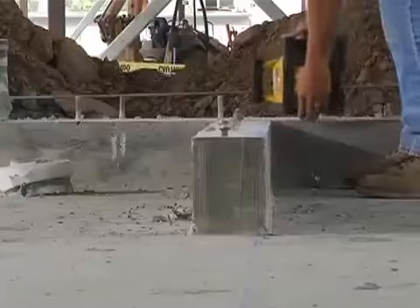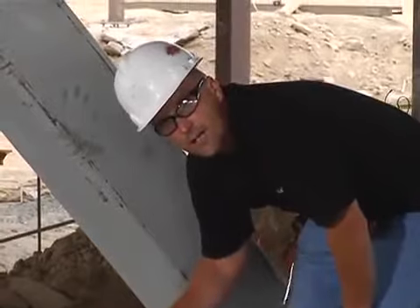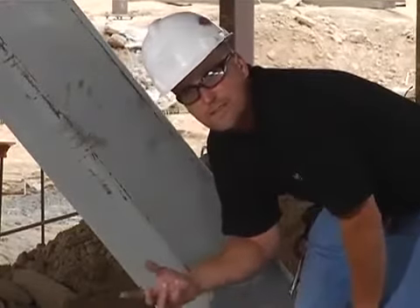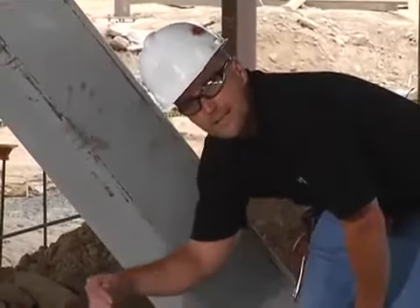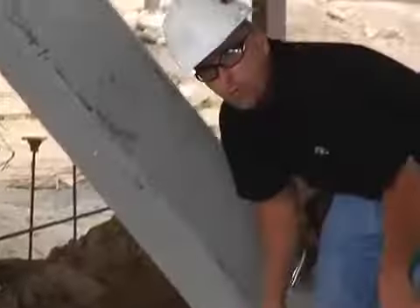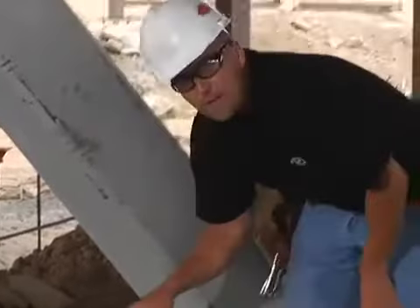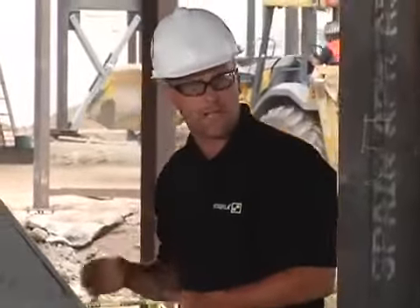First, I lay it down on the chalk line. The laser starts to level on its own, and as soon as it spins, it's plumb. I do a fine adjustment to make sure the laser is lined up exactly on my line. The hard part moving forward is ensuring the spinning laser is lined up on the rest of the line — sometimes 300 feet long. Normally it takes two guys: one on the other end yelling adjustments. It's really frustrating. So we've changed how we do that — I can now do it all by myself.